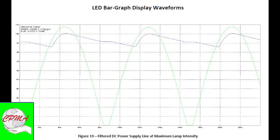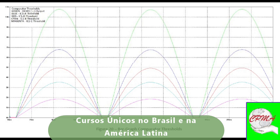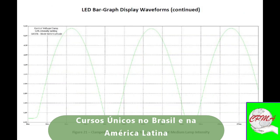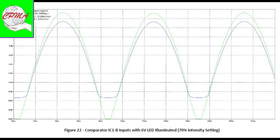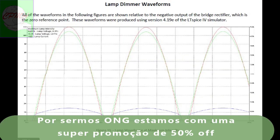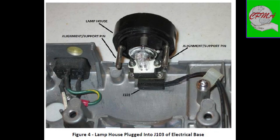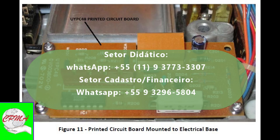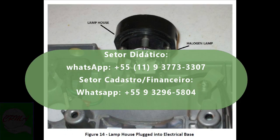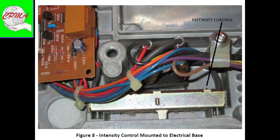The electrical circuitry of the Olympus BHT and BHTU resides completely within the base of the microscope stand. AC power is provided by an AC inlet jack on the back where the line cord connects. There is a power switch on the front to turn the illumination on and off, as well as an intensity control on the right side to vary the lamp voltage. There is a switch on the bottom of the base to allow operation under low line conditions.